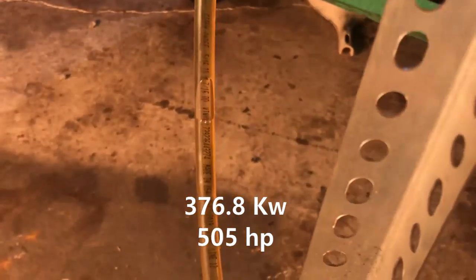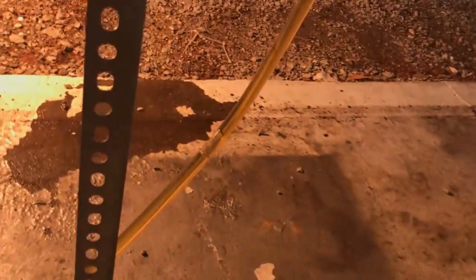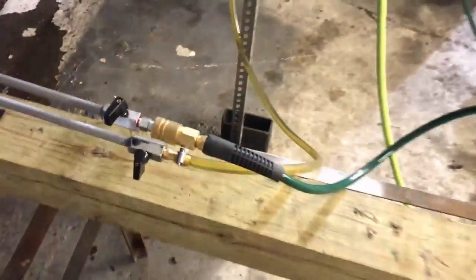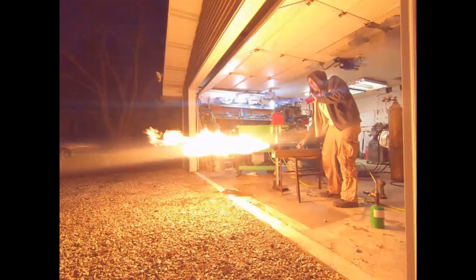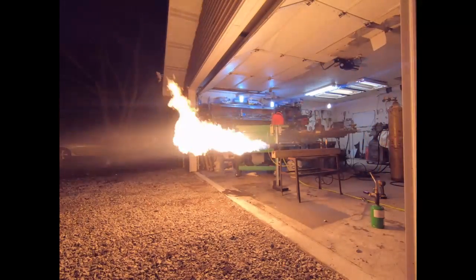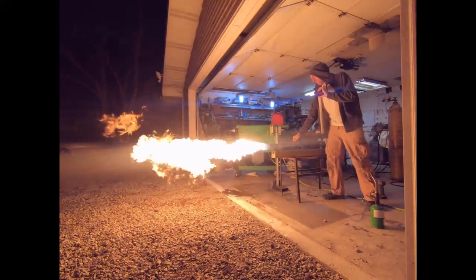It's kind of a bad situation to find yourself in. So if you've got a small vacuum leak, a tiny air bubble gets into the system, and then it grows exponentially because it's under vacuum. That bubble is really the size of a period on a piece of paper most likely, but because this system's under vacuum — watch what happens — bam, flame out. So that's one of the secrets to getting these things working: if you ever find your torch just ain't burning right, chances are you have a small air leak in the fuel line somewhere downstream. Because the bubble's growing in a vacuum, you're going to have problems.